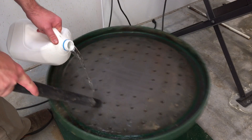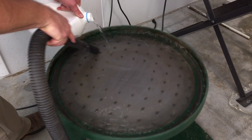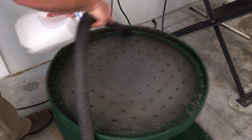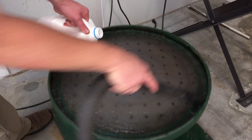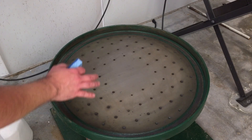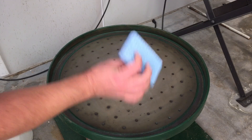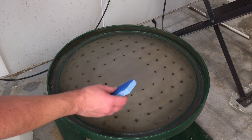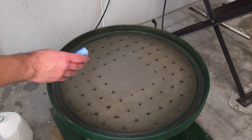You want to be sure to really clean out the Reciprolap extremely well between grits. You do not want to leave any 60 grit or rougher grits on this Reciprolap when you get around to doing your finer grit — it's really important to clean this extremely well. Once you feel like you've gotten a lot of the material out, go over it again with either a plastic bristle brush or a sponge with a good soft scrubbing part. If you use a sponge, use one sponge per grit — don't cross-contaminate. Try to get into all the little divots and scrub all the way around to make sure you've gotten everything out.